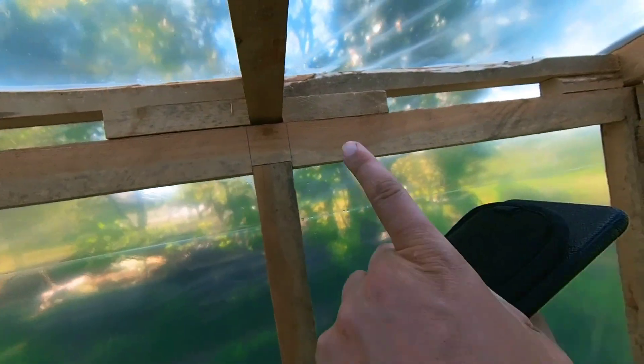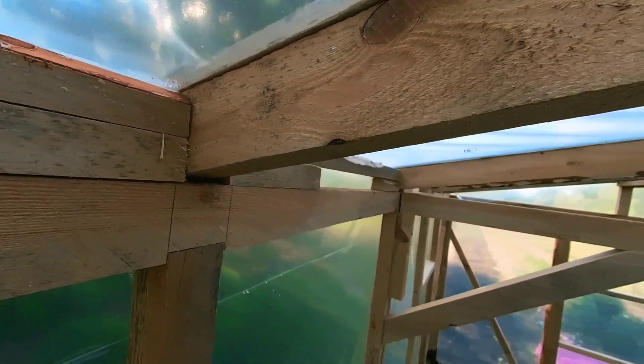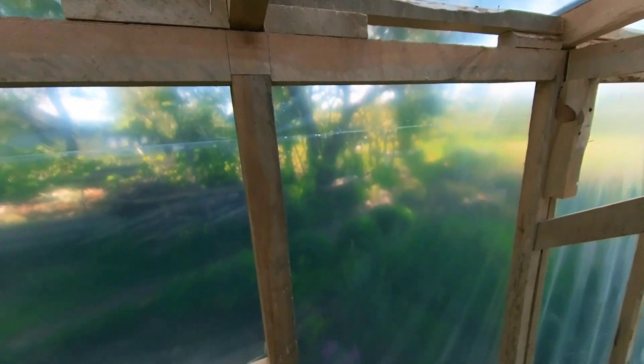What is this fastening for? This fastening is so that the film lies at one level — no height difference — but lies flush with the upper joists, to minimize damage and avoid protrusions that could otherwise puncture the film.